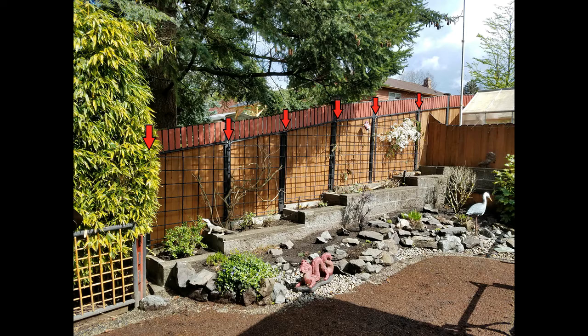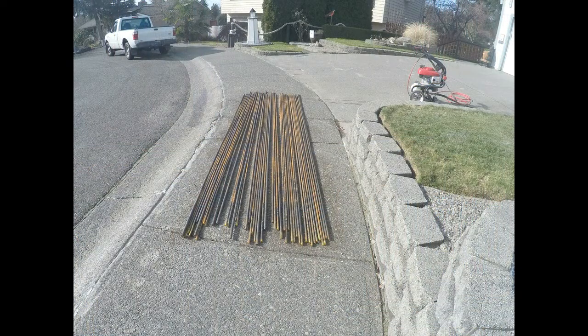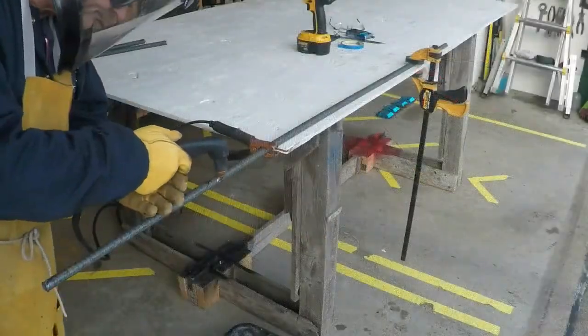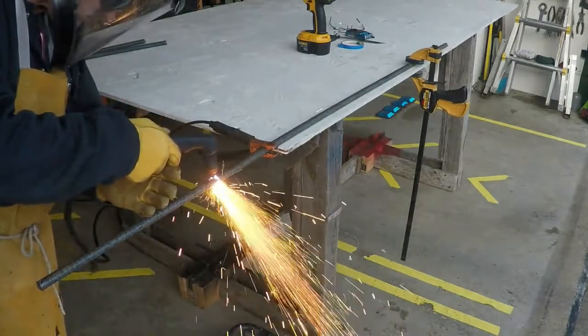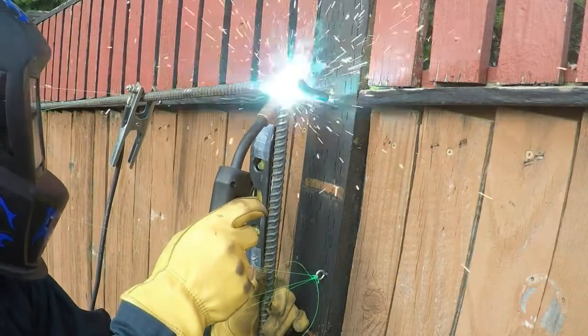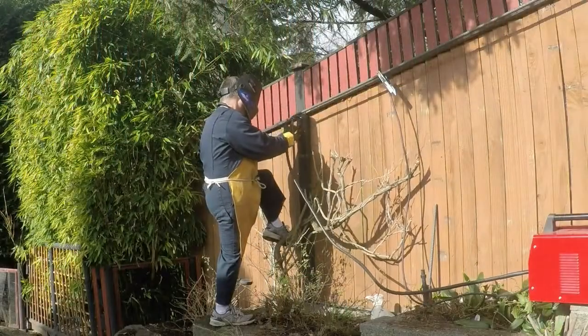The hooks are at a 150-pound rating because until you install the support brackets that you built earlier, they will have to support the full weight of the trellis. The rebar you just purchased is going to be rusty. This rust can be removed with a pressure washer on a nice hot day. You want a hot day because you want the rebar to dry as quickly as possible to avoid re-rusting. Measure your 5/8 inch rebar to the correct size for your frame. Your plasma cutter will easily make these cuts. And if you do it at night, it's quite pretty. Head out to your fence and weld the frame in place. Because of wind currents blowing away my MIG welding gas, I switched the MIG welder to flux core wire. This fixed the problem.